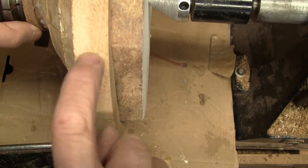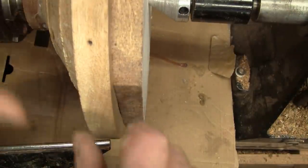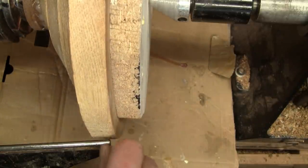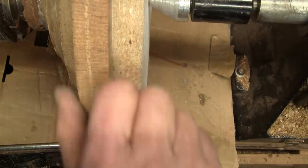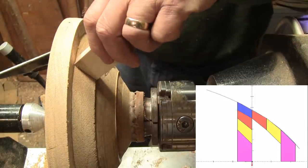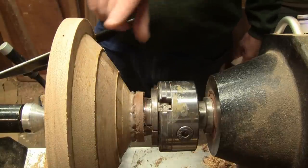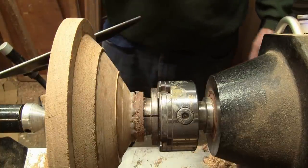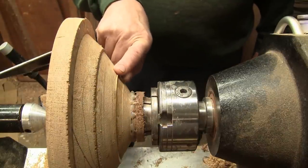I'm going to show you a little trick on adjusting this ring so that it's running concentric with the spindle. If there's a big gap here and I come around and it's touching, and that gap is say a quarter inch, I'll push it an eighth of an inch. Do that a couple of times and the next thing you know, we'll have it running concentric. This is ready to turn — it sat all night. This first ring is cut at 45, this one at 55, and that one at 60. That has the beginning shape of a curved surface on it, very similar to the way I built things with cants. You can do this with a round object or any shape you want.